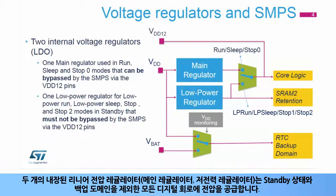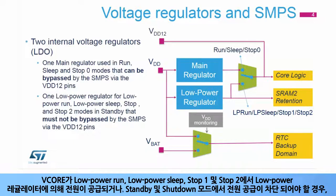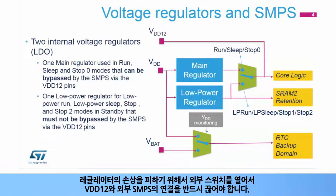Two embedded linear voltage regulators — the main and low power regulators — supply all the digital circuitries except for the standby circuitry and the backup domain. When V-Core is provided by the main voltage regulator during run, sleep, and stop zero modes, the VDD-12 can be supplied by the external SMPS by closing the external switch. When V-Core needs to be powered by the low power regulator during low power run, low power sleep, stop one and stop two modes, or switched off during standby and shutdown modes, VDD-12 must absolutely be previously disconnected from the external SMPS by opening the external switch to avoid any destructive impact on the regulator.